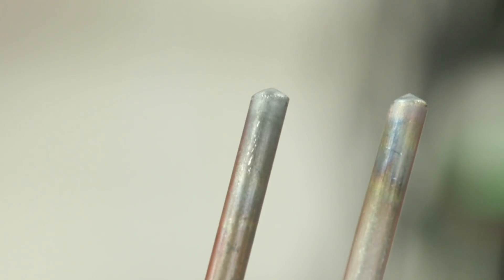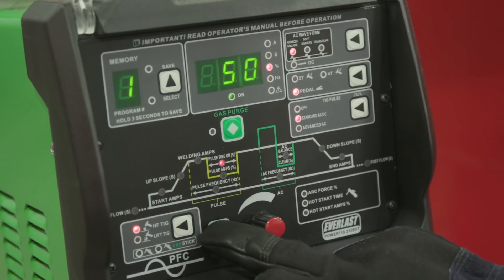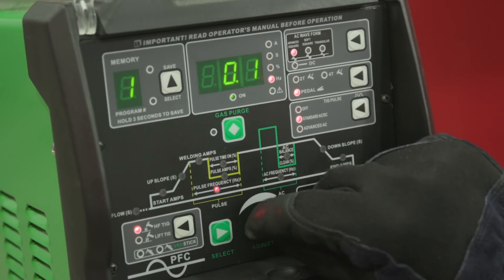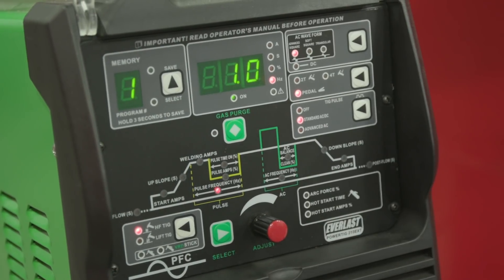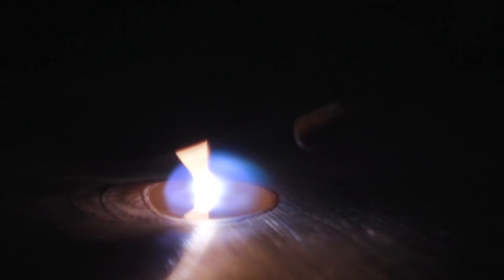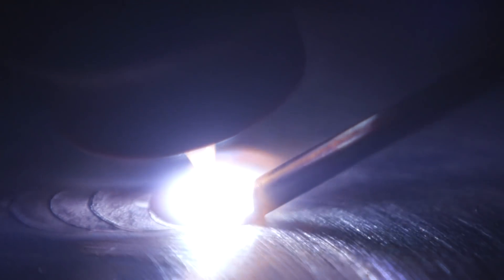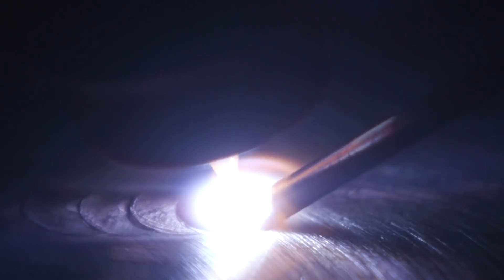Tip number four is building up your muscle memory if you're not having nice consecutive dimes — if you're all over the place, far apart, or close together. One great feature is the pulse setting on your machine. We're going to set the pulse to one second and I'll show you how it's done. As soon as it goes off, you want to step up, put it in, step up, put it in — I usually step up for the puddle. Let's find that leading edge of it. Just going like that. Pretty simple, right? Yeah, it's like a guideline, watching that pulse.